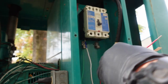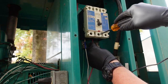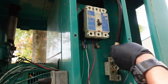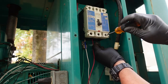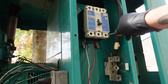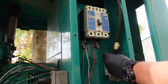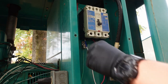But the plan is to draw around 20 amps, which is fine for number 12. And there's actually the right size breaker on the panel, so if there's an overdraw, it's gonna blow the panel breaker first. And then this is almost like a backup fuse. I mean, it's not ideal. But eventually this is gonna be an actual 100 amp panel off of this breaker. And we'll put bigger wire in it.